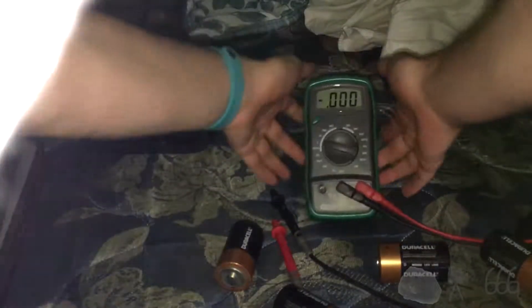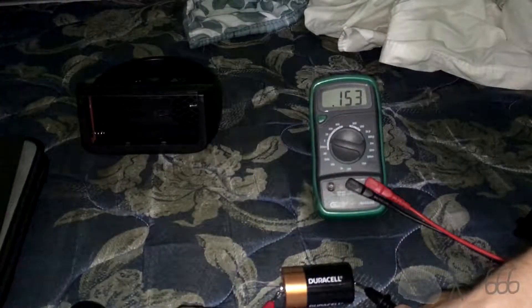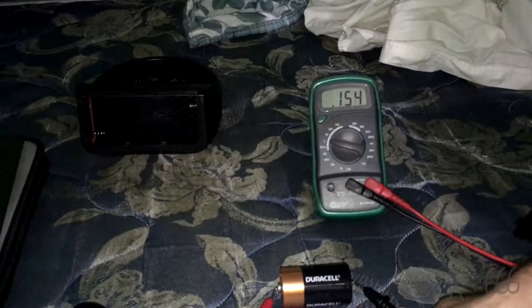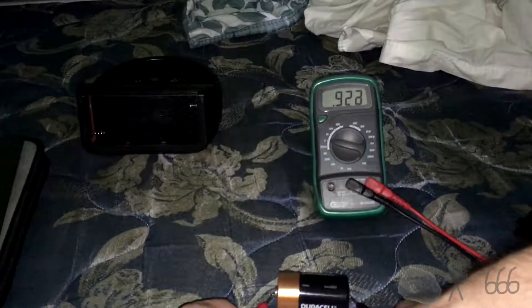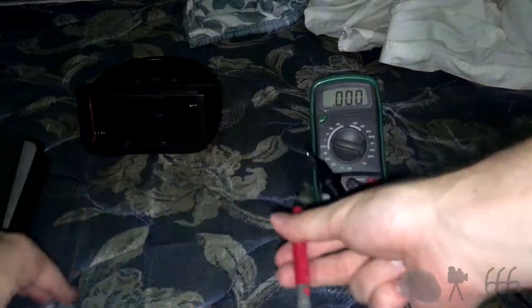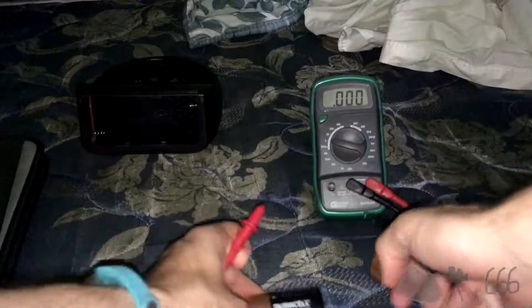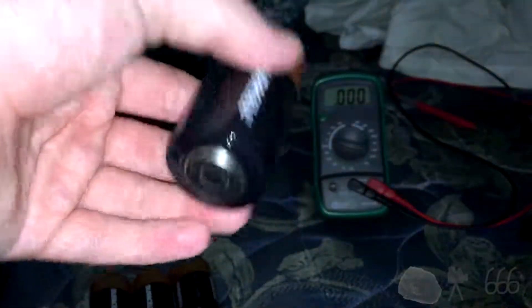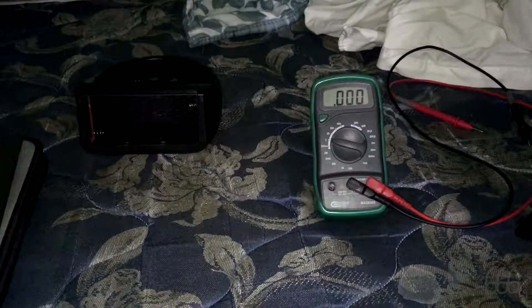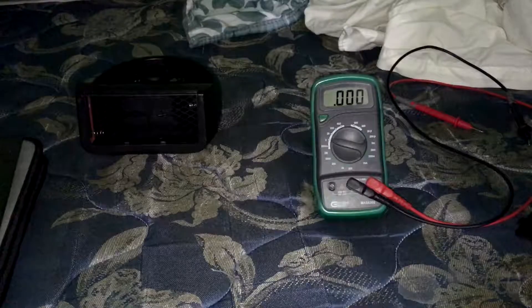They have a maximum voltage of 1.5V. This meter is a piece of crap — I really need a better one, but it's good enough for this. That first one is toast; it measures about 150 millivolts. These are Duracell batteries, so I don't really have a high opinion of them. The next one measures 922 millivolts — a little better. The remaining two also measure around 900 millivolts each. So three of them measure around the same, and one has obviously worn down to being completely useless. I'll probably put the three in my spare bin; the dead one is totally junk.